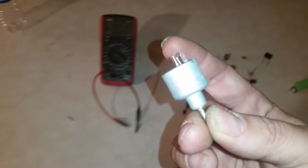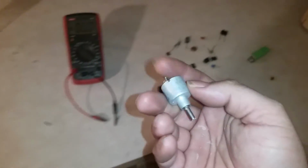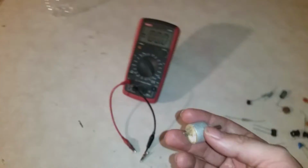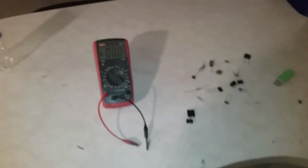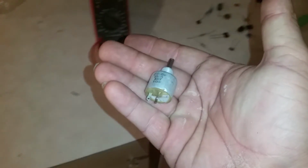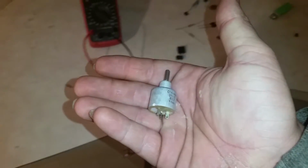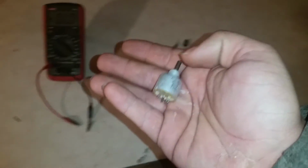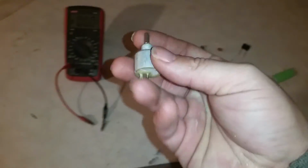This right here is the size resistor that we use for our pots on the front of the amps, the driver amps, the smaller amps, so they can have a little bit of control to turn the amp up and down. I won't get deep into it, but it's basically just putting resistance. And so that's another thing about resistors, Astra. It is what it says it is. Resistance is putting resistance on things. So this right here, for example, I could put 10 volts through this thing, just as an example, and vary the pot right here. I could put 10 volts going in it, and out of it, it could be 8 volts. It could be 6 volts. This is just an example, because I can vary the resistance that it's putting on it.